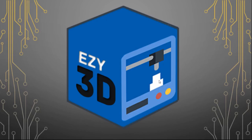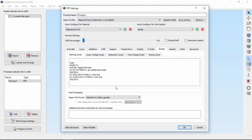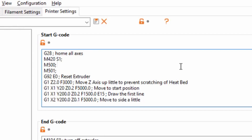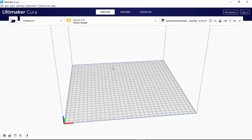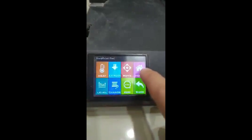The problem with the first version that I released is that it sometimes does not load the mesh even if the restore leveling after G28 was uncommented. So the fix here is to add M420 S1 after the G28 command to ensure that every time we start the print, it will load whatever is inside the EEPROM, which is the mesh data.